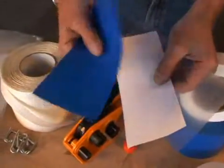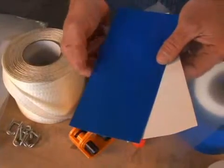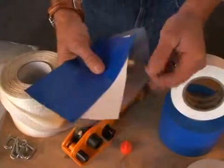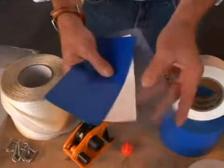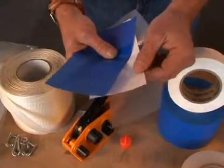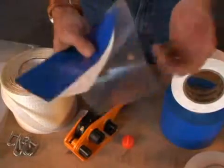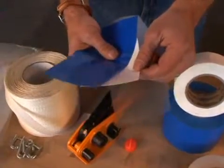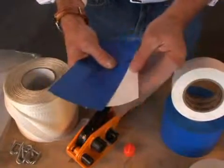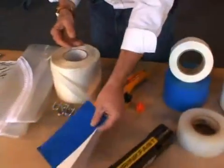The blue works very well in colder climates as a cover for boats. This absorbs heat and allows the snow to slide right off. For other applications, machinery, boats that will be stored even in a warmer climate, white works much better. It reflects heat, stays much tighter than either of the other two colors on warm days. And the white reflecting also keeps the product underneath much cooler, which will eliminate condensation also. So we have the heat tool, and we also have the shrink wrap as the second part.